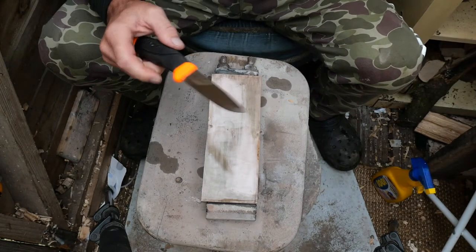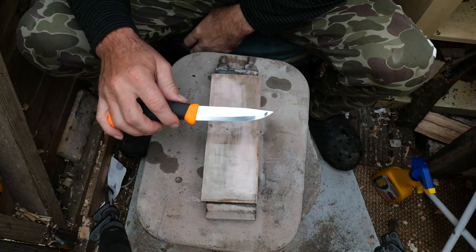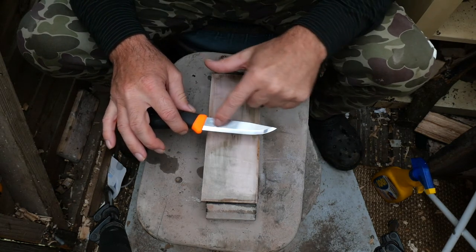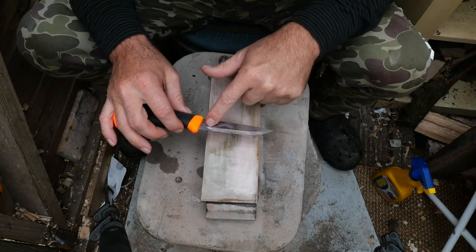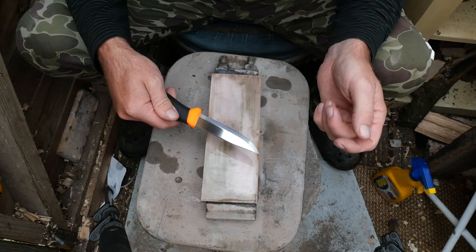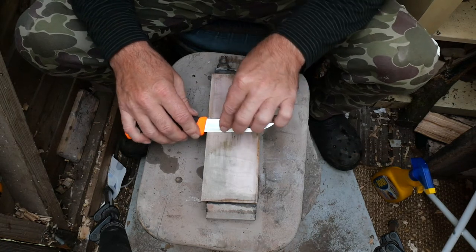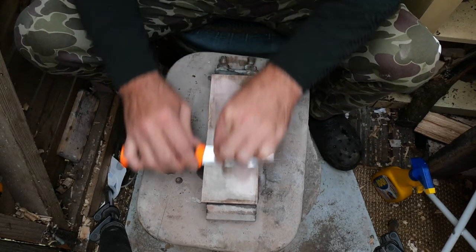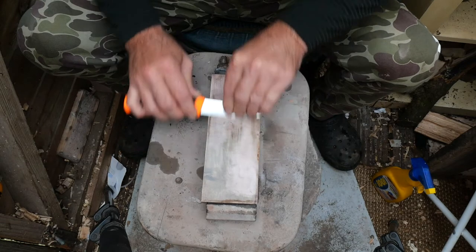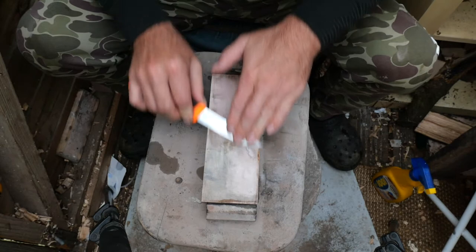Okay, back again. What I thought we'd do this time is sharpen this knife. If you watched my previous video, this has got a very quick micro convex that I put on it, but now I'm going to sharpen it Scandi. I'm just going to rest it flat on the bevel and sharpen it like I'm doing now — flat on the bevel, proper Scandi — and come up with a Scandi finished result, and then we're going to test it.